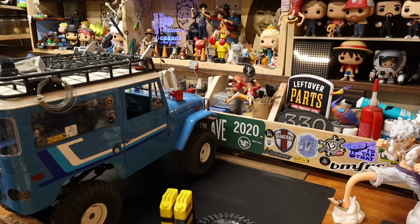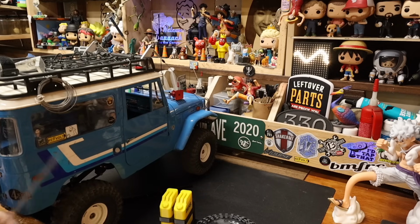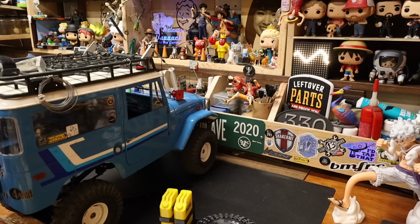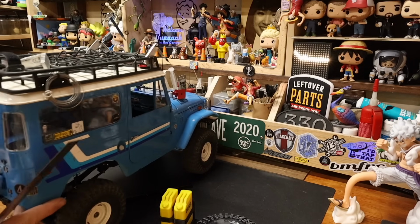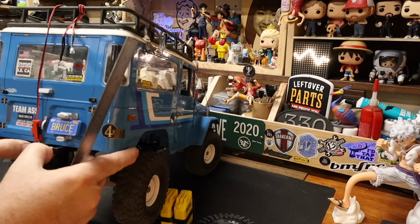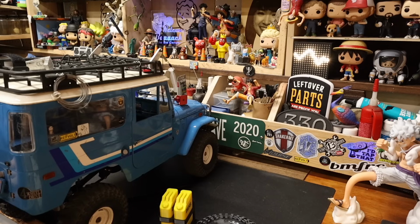We get ourselves a ruler, and we measure outside to outside is 69 millimeters. Now, can we flex them and make it 70? Because I would prefer it to be 70. Yes, we can. I was slightly out of frame. We give it a little bit of one of those. I would much rather find the middle of 70 millimeters. So we've got 70 millimeter outside to outside, and then inside to inside is 53.